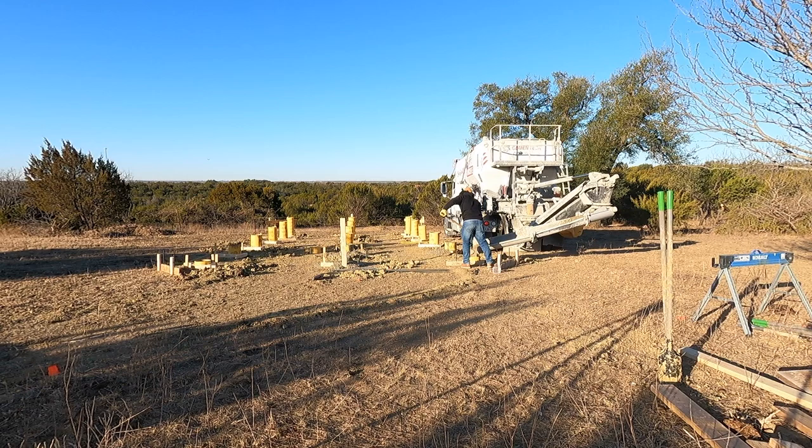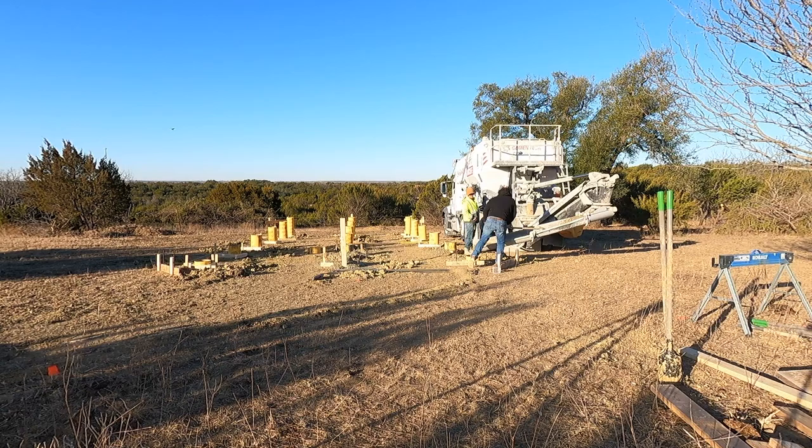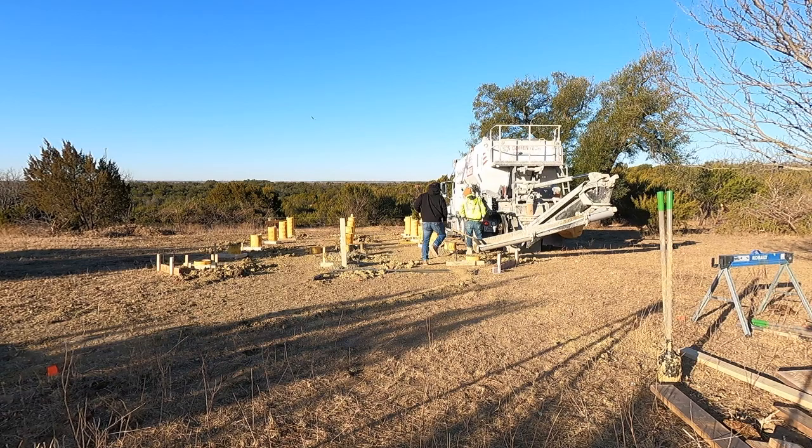You can also pour — which I did with the addition, and you'll see that later — a 24 by 24 square pad that I dug into the ground and then put six-by-sixes coming up from that. That's another way to do it. But overall, that's really the only reason I decided to pour concrete to grade: to get it up off the ground and not have lumber close to the dirt.